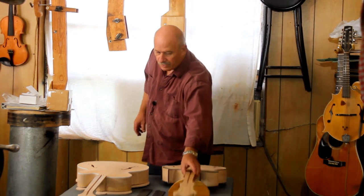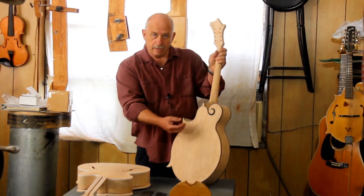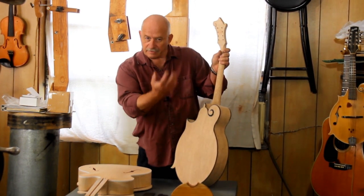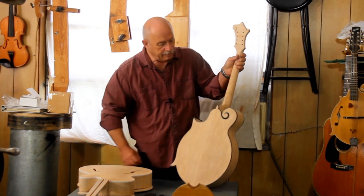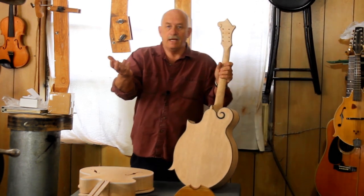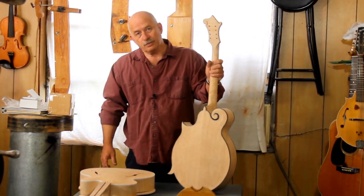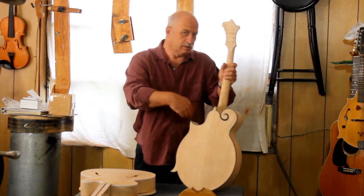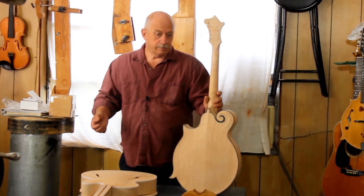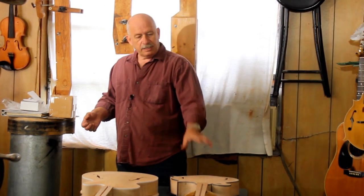This one here, of course, was held up mainly because of the binding job. It's a 2-ply double-step binding routine here, and there's 7 pieces of binding, and it has to be double done to get the inner black, white, black, and so therefore it's 14 pieces of binding just on the back alone. If you glue 1 piece a day and come back and glue another piece tomorrow, and so on and so forth, then you got 14 days worth of gluing. And we can press that up a little bit by gluing a little bit in the morning and a little bit in the evening, but nevertheless it's still quite a job just to get all the binding glued on after you've got the channels cut. So that one's done and can move on.